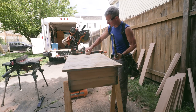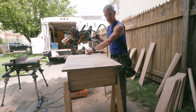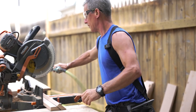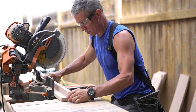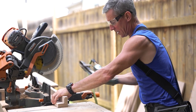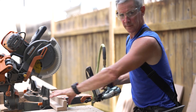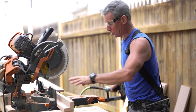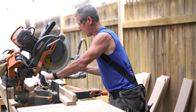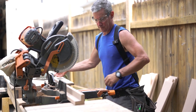Lots of different ways you can do this. I prefer to use my miter saw as a backstop. And if you don't have a narrow crown stapler, well, I think you should, and you know what? I'll wait. I'm not gonna wait. So using the miter saw and my work table, what I wanna do is get these nice and square, then upside down, pinky grab. I'll freeze that miter. If I'm gonna try to blow screws and stuff in here now, something's gonna move. I just need to tack it. And I love using a narrow crown stapler for that activity. Okay, that's the first layer.